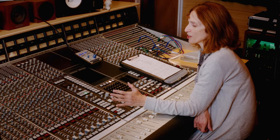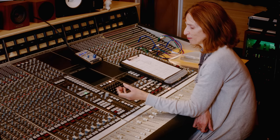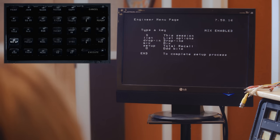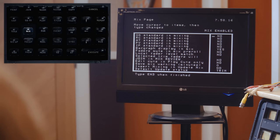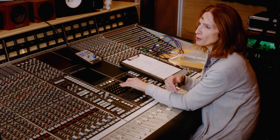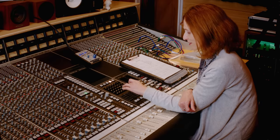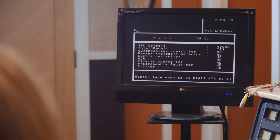The automation system isn't just the modes at the head of the mix — there is also a setup page where you can configure how the modes work. We get into that by pressing SETUP, then Y to see more, then the MIX button. Here we can set up whether we want the five automation modes to come up as standard without selecting them each time, and see other modes we may want to alter — for example, insert mixing.